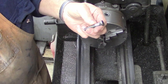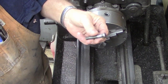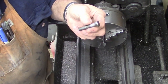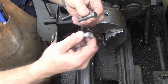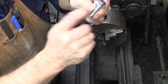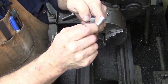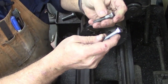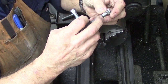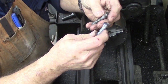Now let's proceed with making one of these little studs. This is a factory stud for our gear change - to carry our gears on the banjo on the 10-inch lathe, 10 and 12 inch. What a lot of these guys are doing and selling on flea bay is they are taking this stud and reproducing them so that they look like this. Some of these have got a threaded shank or an unthreaded portion on them. I haven't found a source for the unthreaded portion up on the top, which would match the original. I don't think it's a major thing - it's riding on a steel bearing and where the threads start on this do not go out to where the gears are carried anyway. They're getting about $10 to $12 a piece for them.